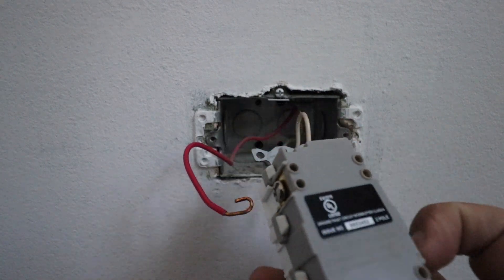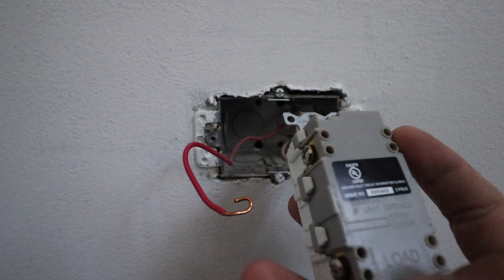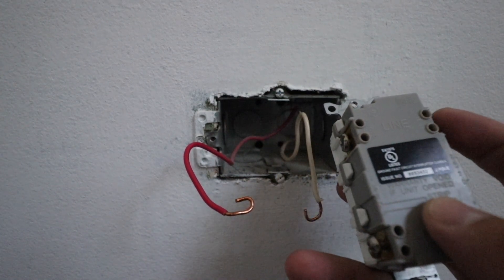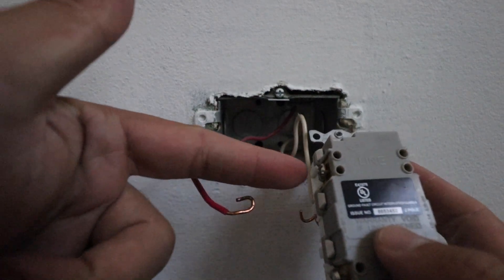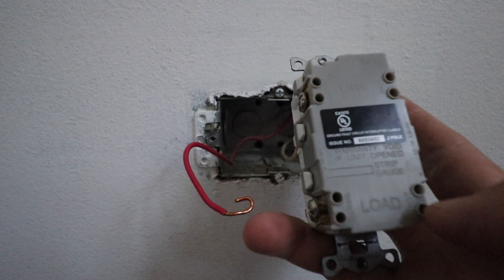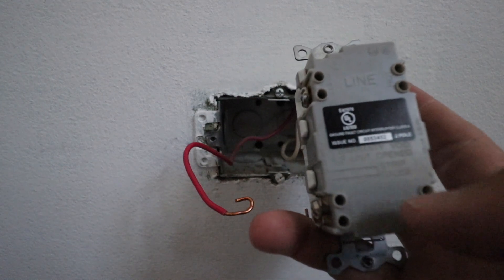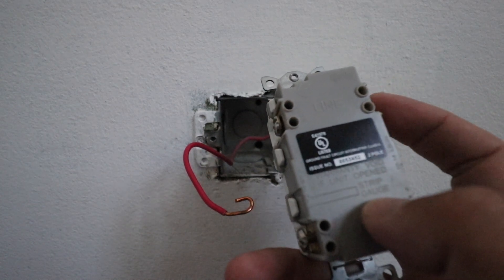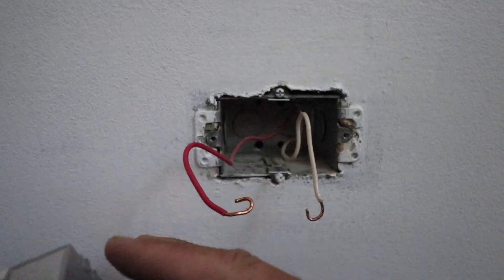On the back of this you're going to be able to see where it says load and line. The line is the colored wire — the hot wire. In this case the red wire is the hot wire. The white wire is the neutral wire, so we're going to put our hot red wire on the terminal where it says hot on the back, and our white neutral wire on the other terminal. The additional terminals lower down are for if you wanted to protect another outlet with this GFCI — you'd connect it there and extend the circuit to that other outlet, since a GFCI can protect outlets downstream of it on the same circuit. If you have a ground wire you'd wire that into the green terminal as well.